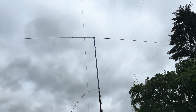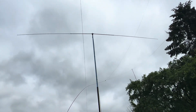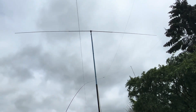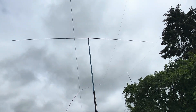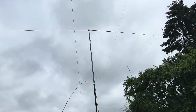The telescopics are 14 and a half feet long fully extended, which means you can build a resonant dipole from 70 MHz down to 14.3 MHz. At the moment for 10 meters, each of them is basically 2.5 meters long. The way I've got it mounted, I wouldn't want to go much further than that.